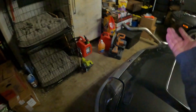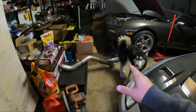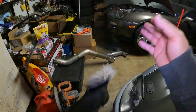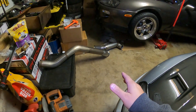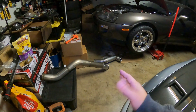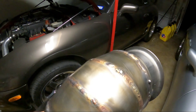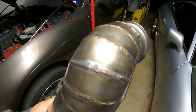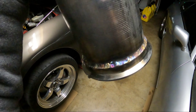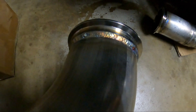I did weld the flange for the 38mm wastegate. Let me show you guys some of my welds. I did learn a lot — fitment is key, so I will focus a lot more on fitment for the pie cuts. I also learned about gas coverage. On these welds here I definitely didn't have enough gas coverage — that's why the colors aren't the prettiest and my fit-up was terrible. But once I learned from my errors — beautiful, beautiful colors. Definitely getting better.